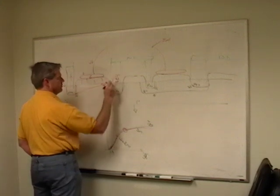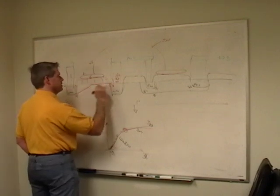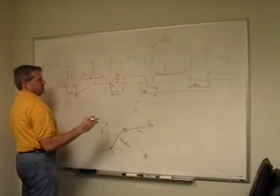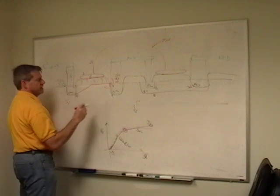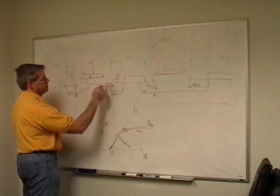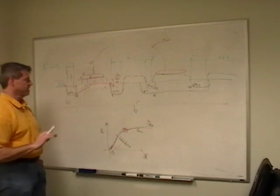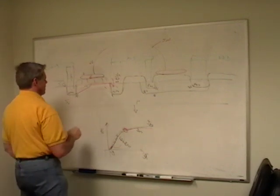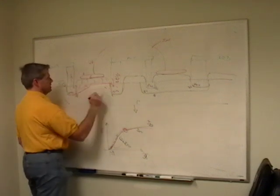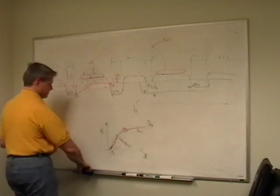Now if I keep increasing this voltage, what happens is I start to modulate the channel this way, where my channel's pushed way over here, but the electrons have enough energy coming in, there's enough of a field this way to go ahead and pull them across this area in. I'm not sure it's tunneling, but they're moving pretty quick. And you can eventually get to the point where you get to punch through, where this basically collapses and it doesn't matter what happens, and then you go into avalanche and bad things happen. And there's another little mushroom cloud.